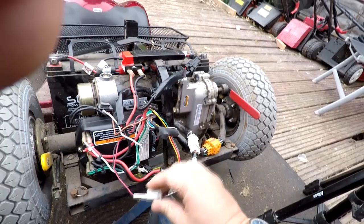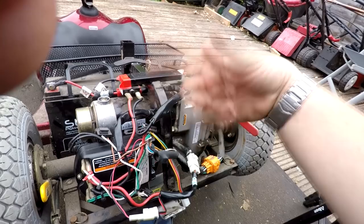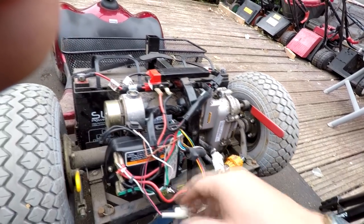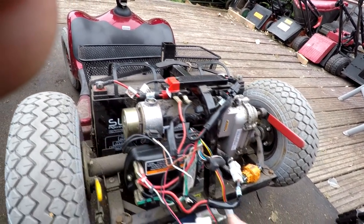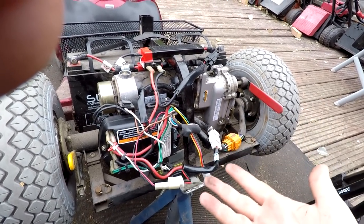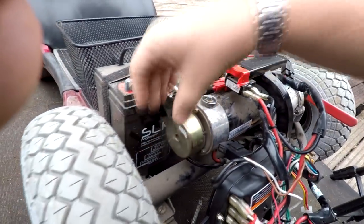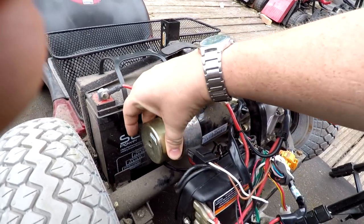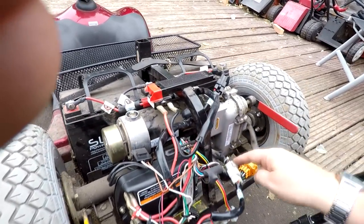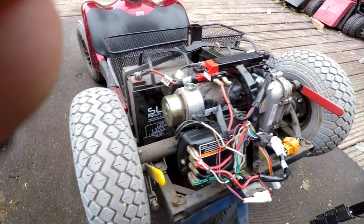What I could do is apply 12 volts to the solenoid and to the motor to see whether the motor actually spins. But you can't really do that properly until you've removed the solenoid or applied voltage directly. I'm quite limited with test leads here. The easiest thing is to remove the drive wheel on this side, which will give me access to the three screws to take off the electronic brake solenoid. I can then apply 24 or 12 volts to the motor to see if it rotates. I'm going to take the wheel off and then take the brake off.